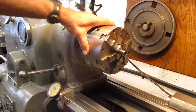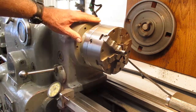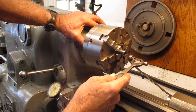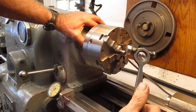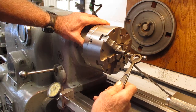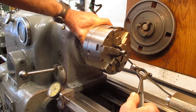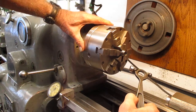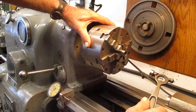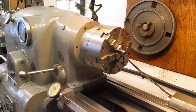What I've got in here is an old-time thing called a drill bushing. It's precision ground on the outside, which is nice because it's smooth. I've got it in there pretty good using a one-eyed hammer — you look and then tap, tap, tap. It's like a brass bushing and you don't want to hold it too tight because you'll distort it. So we've got it snug but not too tight.